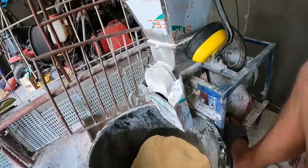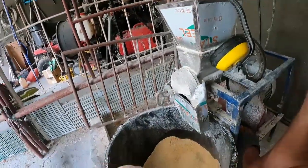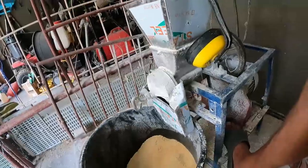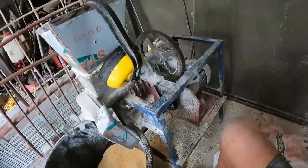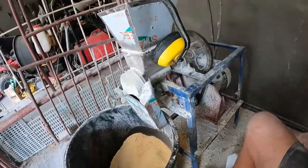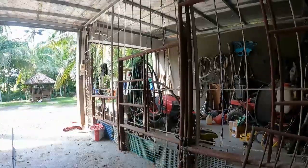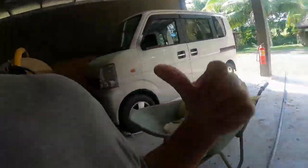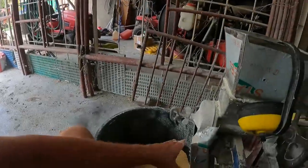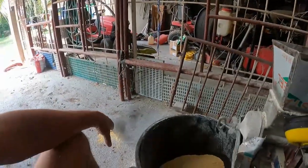So I thought, right, let's make up a proper chute for this, where the rough stuff can go out one end and the powder can go down the other. So that's what I'm going to do. Now, to do that, I'm going to have to extend the legs on this and bring this up higher so that I can feed it with the two chutes underneath. I've got enough wood over here, and I've got ply over here that I can make up the chutes, so that this can come down, run through a screen, and then come out. There's the rough stuff I can put through again.